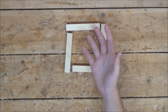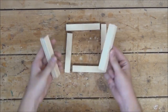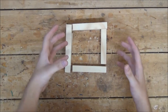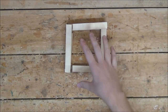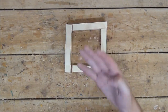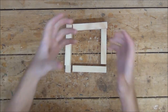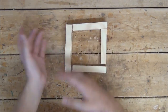After we finish gluing and nailing the first level, we'll repeat the whole process for the second level, but in reverse — instead of placing the second level like this, we'll place them like this, making sure to cover up the joints. This will not only look better, but also make the unit a whole lot stronger. Now, we're going to want this thing to be about 16 inches thick, and so for the first four levels and the last four levels, we're going to want to use the 41-inch long pieces on the sides as well so that they stick out like legs.